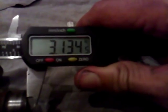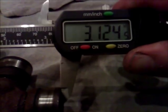And in that first video, you see that they got to have these clips. Well, I did some research, and they were 315G, which I believe is for the grease zerk. But I found these at AutoZone, and let's see what size these are. I probably need to switch this to inches. So we switch this to inches, and if you can see that, that's 317, and that's what these measure at, 312, and these are 315G. Now this is one that's been beat on with a hammer, so that's a little bit out of spec, 312, so they're going to try to sell you a 315.